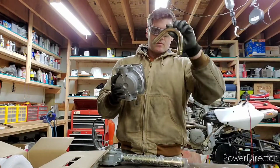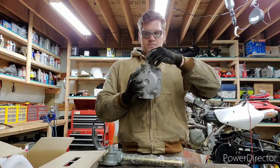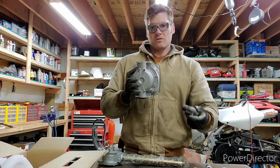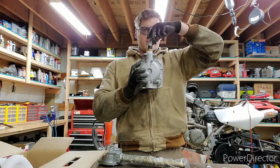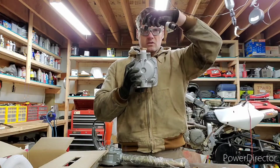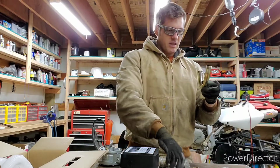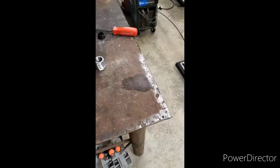and then instead of using the supplied exit pipe that came with the kit, I'm going to create my own out the end like that with a 3/4 inch nipple on the end. I have another reducer I'm going to use on this as well, so I guess it's going to go something like this. Reducer, 3/4 inch black iron to my pipe to create a little nozzle coming off the end. So the first step is going to be cutting down this guy to fit into the end of this guy and welding it up and seeing how it looks. So let's get started.